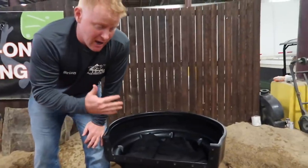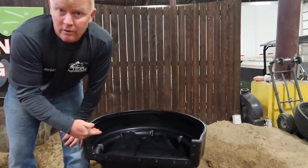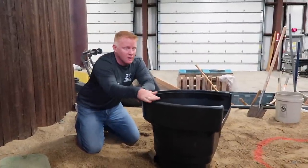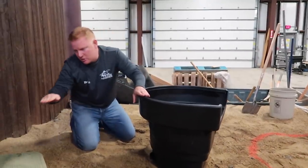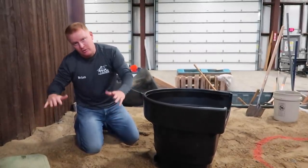And you'll be so impressed with how creative we can get with the waterfall at an 18, 17 inch high waterfall. We always call it that 2 foot, 3 foot rule. Whatever height the pool is, we want the dirt to come out flat, 2 to 3 feet, and then slowly taper. So once I drop this down, it'll make it even easier to do that.